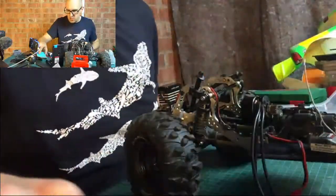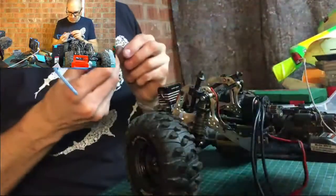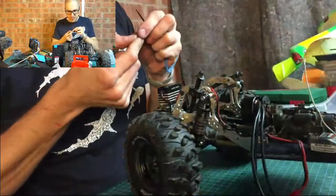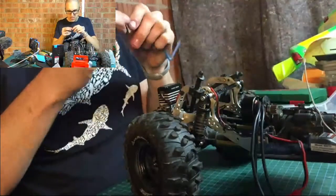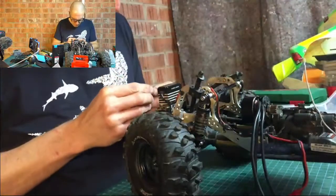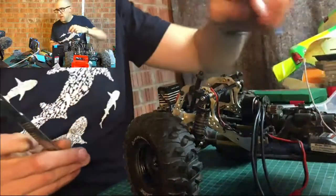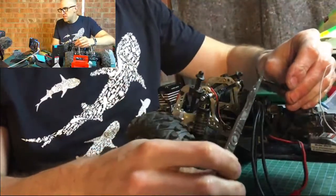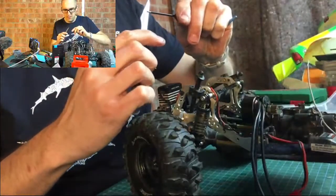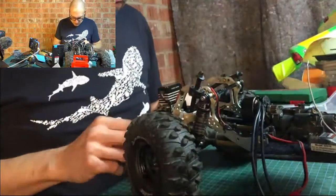Now they do have specific instructions and I completely ignore them and just wind in the helicoil, provided it's going to fit, because they do have things for you to ream stuff out and squeeze things in and everything else, but I found that you don't necessarily need them. What I do need though is to just open up. So this tool has a little slit in it that allows me to hold the helicoil or get it in there. That was just full of gunk.